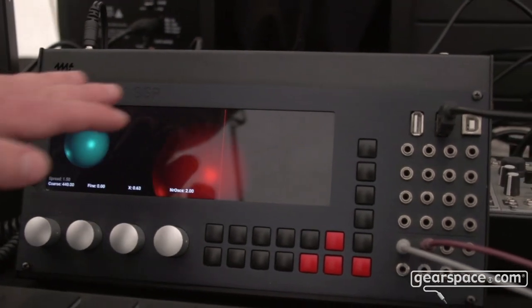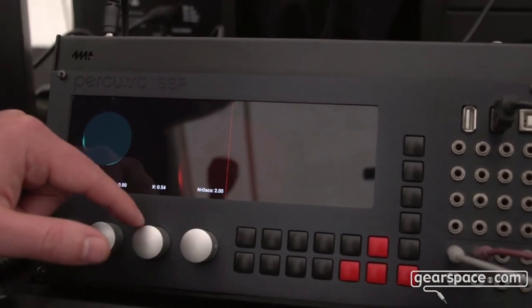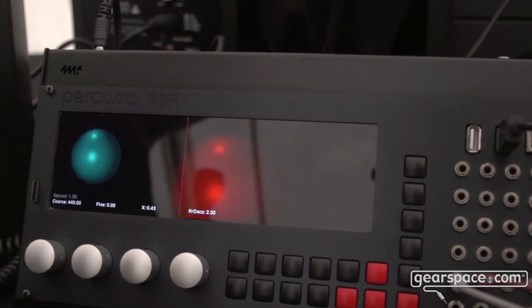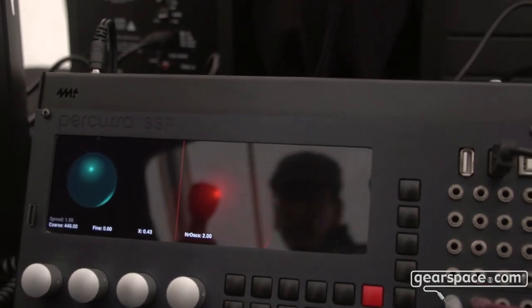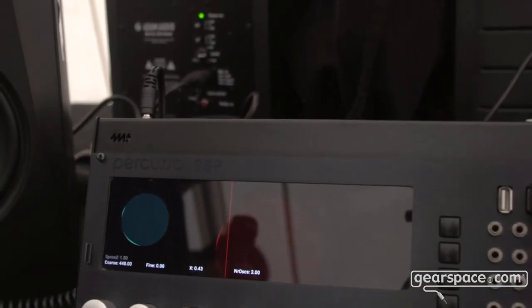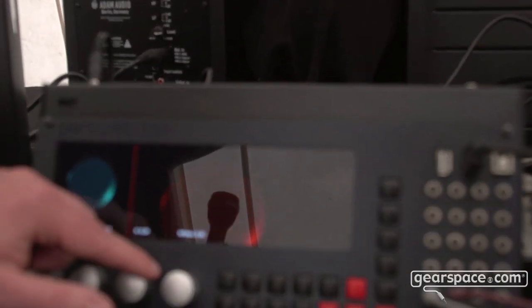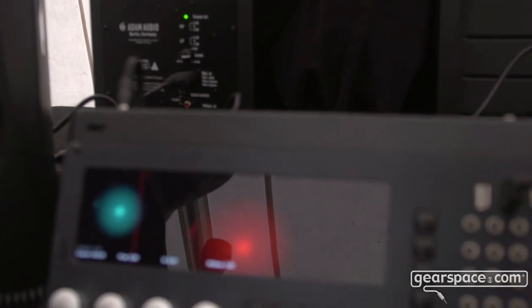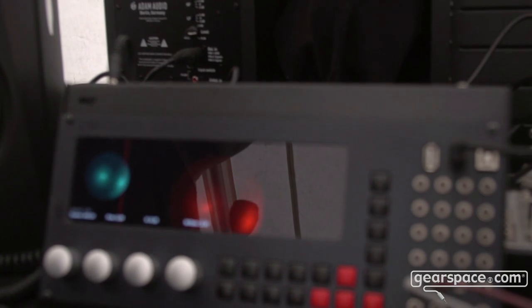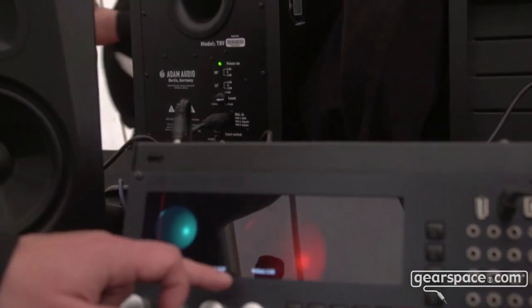You can see that when the light moves under the line the sound kind of changes. I can move the scanning line closer to the edge, and then you see the sound will change — it becomes more aggressive as the section here is smaller, so you get a different kind of waveform. Of course if you move the line over the other sphere, you get a similar sound but not quite the same because the sphere has a different color and so the outputs give you a different signal. If you move it in the middle you get a less aggressive sound, while moving it to the edge gives you a more aggressive sound again.